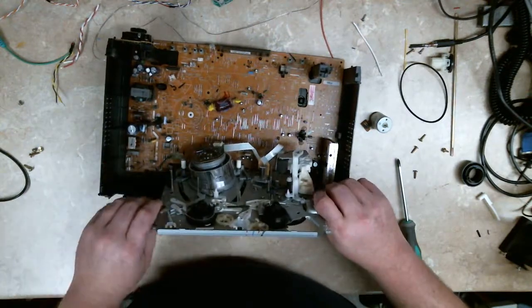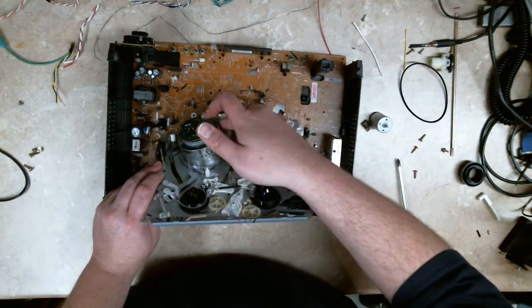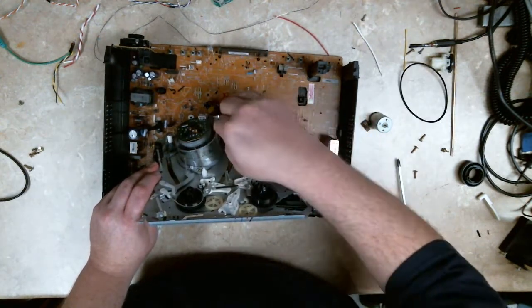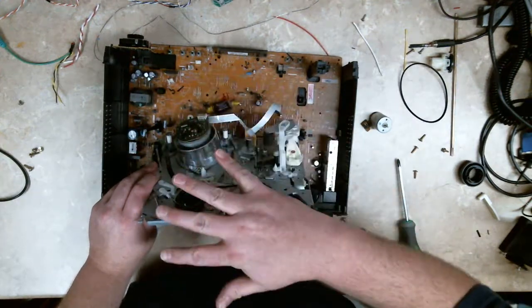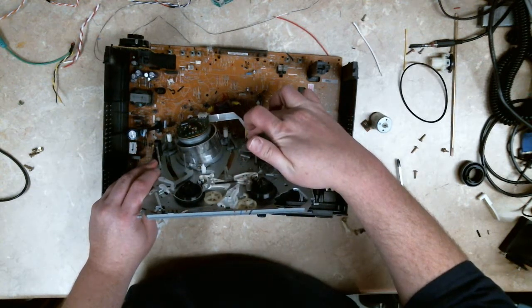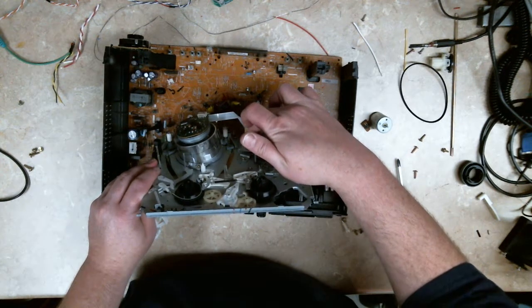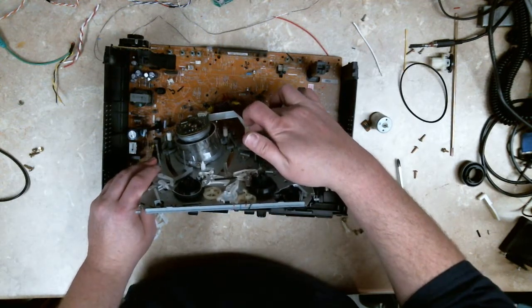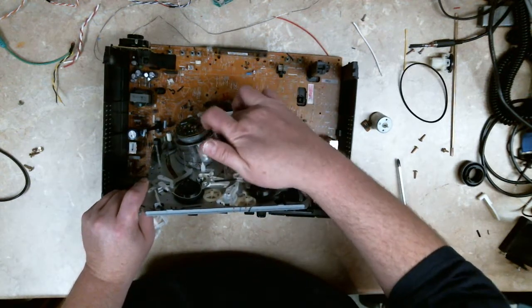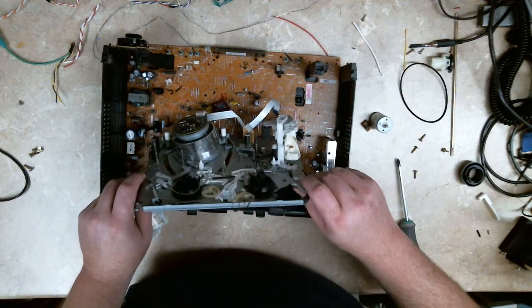The way that this whole magic device works, just in case you care, you might say, well, how do they keep this in sync, right? Because if you remember, the tapes had multiple speeds on them, some even had a dial to select the speed when you're recording. It didn't matter what speed you recorded at, because this head would always pick up the sync pulse. The sync pulse was written to a little stripe at the bottom, about a millimeter wide, and this little gizmo would pick up the sync pulse and adjust the rotational speed of this head here to match the sync pulse exactly.